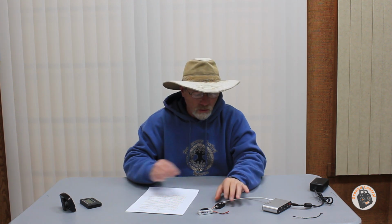And that's the way balance chargers work. They'll fast charge it till it gets to a certain point, and then they will really back off and make sure that the voltage of the battery gets completely to 4.2 volts per cell and that it holds that voltage. So, when you first connect, it uses a USB-C cable. It came with this USB cable. I've just got a powered USB hub up here to plug it into.